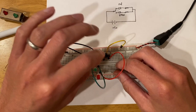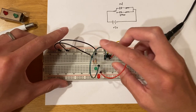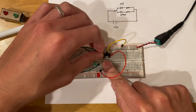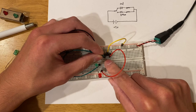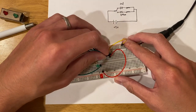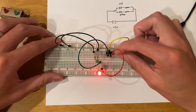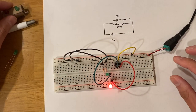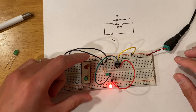I found the issue — on this side I actually connected to the wrong pin. I should have connected to pin 24 but I connected to pin 25. There should have been just one empty spot between the green and red LED pins because it's a three-pin switch, so it was effectively disconnected the whole time. Now the green light goes on, and if I switch to the right-hand side, the red LED goes on. That's how we built the simple traffic light — hope you like it!